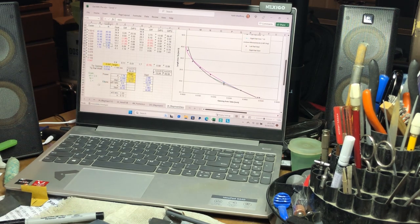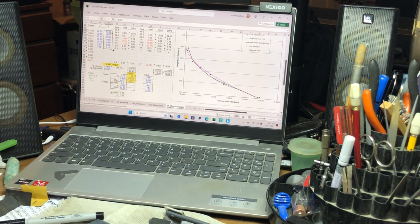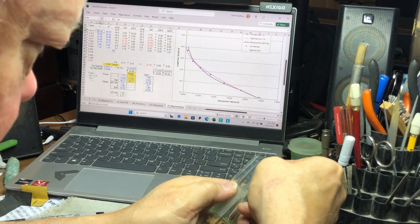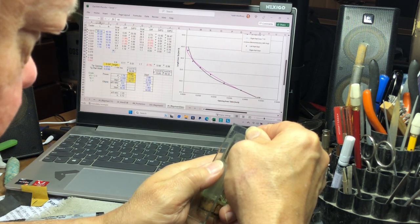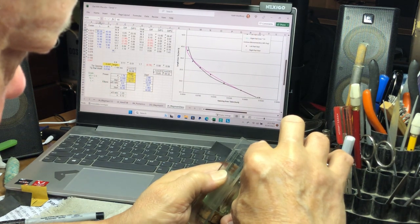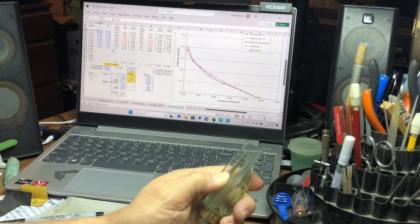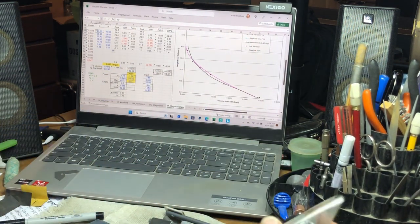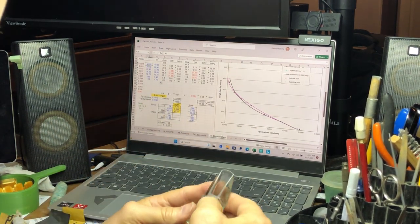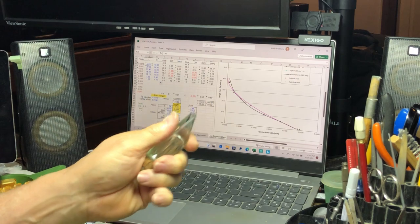So now let's take a full set of readings. Okay, go up here again, make the right equal to the left, copy it down. So, 15 feeler. I'm getting 40, 41. So before I go any further, I'm going to flatten this table some more. After about another 20 strokes, I got the facing length down to 35 again. Let's try this.